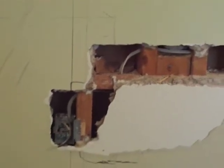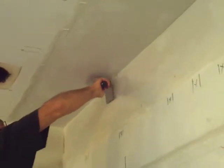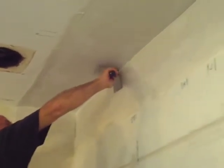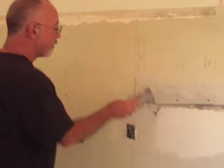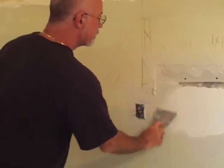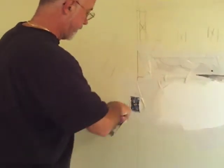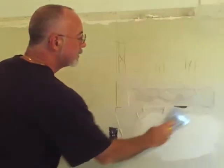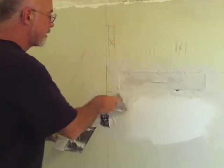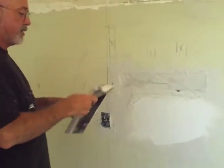I'm going to be getting close to my day's end. I'll have to cut a piece of drywall to fit into that and mud that. What we've done is put extra pieces of drywall in the big hole and we'll put the screening mesh over it. Right now I'm just putting mud on the mesh to fill the hole, let it harden, and we'll just keep putting applications on. About the fourth application we'll be able to smooth it out and it should be ready for painting.